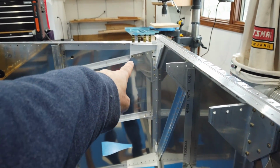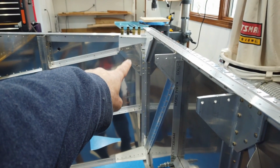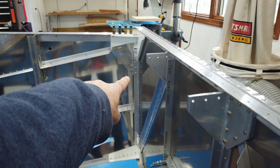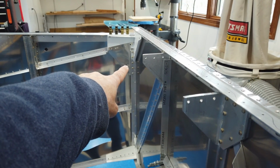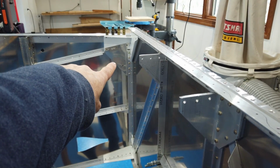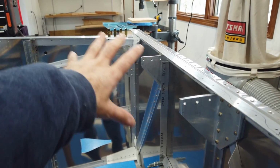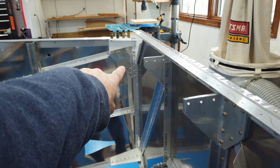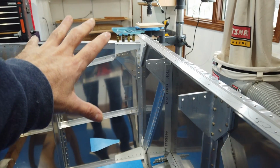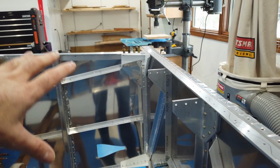The gussets, these gussets here, those have to be pre-riveted only to the firewall bracket like you see here. Those kinds of notes are written in the instructions. Make sure you don't miss them, because if you get all this riveted, you won't be able to get that gusset in place. But that's how I worked. I just worked basically a piece at a time.